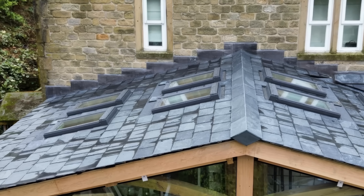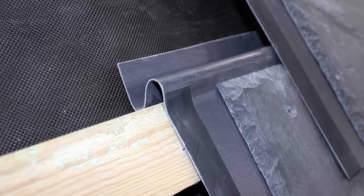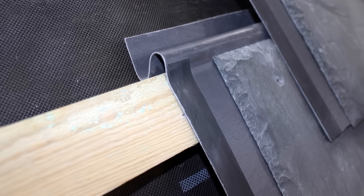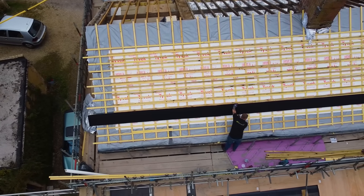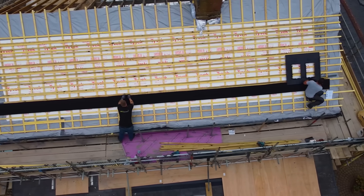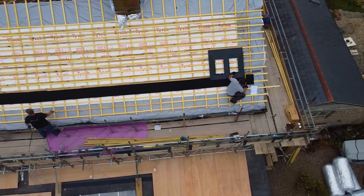A real man can walk on them without fear of breaking them. It's a kind of laminate system - it's got GRP underneath and then natural slate on top. So it looks like real slate and it is real slate, but underneath there's a GRP solution. So it's kind of a secondary barrier. So it interlocks, so you don't have to worry so much about the headlap. You use fewer tiles and therefore it's very economical - each tile looks expensive individually but you're using less of them, so it works out very cost effective.